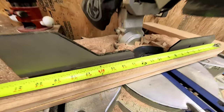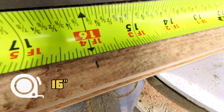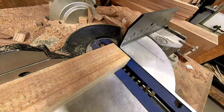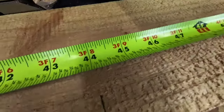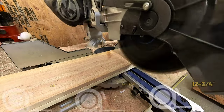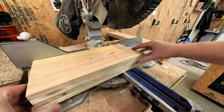At the miter saw, I took two of the ripped down one and three quarters inch pieces and cut them to sixteen inches for the legs. After making my first cut, I repeat the cut using one of the legs as a guide. Four pickets get cut to 44 inches long, then we cut two twelve and three quarters inch pieces as well — this takes care of the sides. With only four pickets, we now have all four long sides, four short sides, and four of our bottom boards.